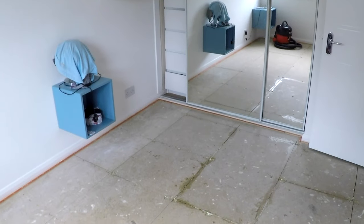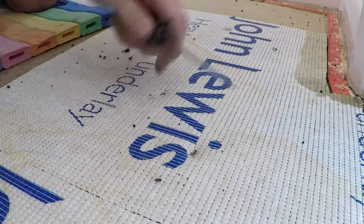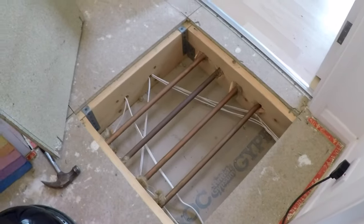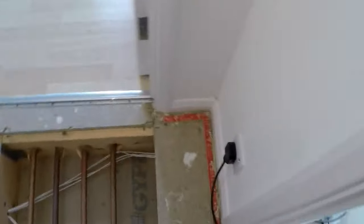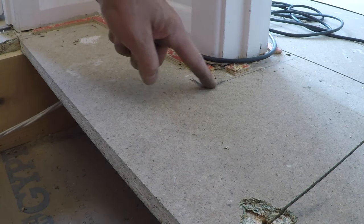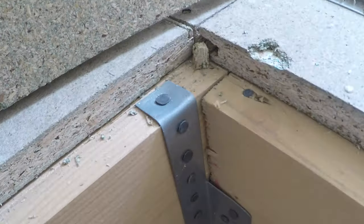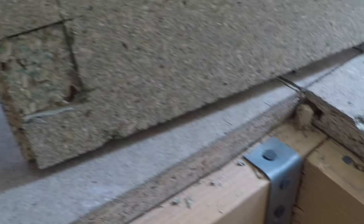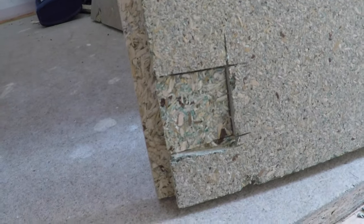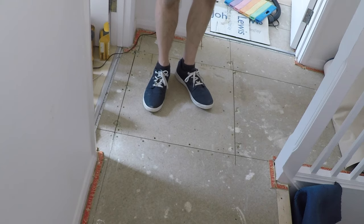That's finished. I had to lift about two-thirds of the floor — it's not perfect, but it is considerably quieter now. Having done the bedroom, I realized the hall floor was just as bad, so I had to sort that out too. I've lifted out a square panel between the bedroom and bathroom doors. This L-shaped section seemed particularly noisy, so I decided to isolate this piece of floor by cutting it close to the wall, fixing several noggins, and screwing it all back down. I discovered that two metal joist hangers were preventing the floor from sitting flat, so I fixed that by chiseling out a couple of recesses in the underside — now it sits down flush.